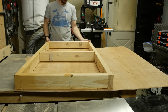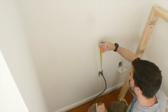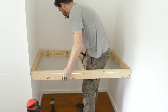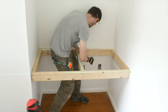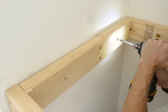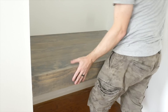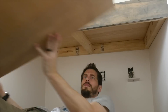I laid the frame over a piece of 1/8-inch plywood, cut it to size for the bottom, then measured up to the height where I wanted the frame to stop and used a laser level to mark that point on all three walls. I went around making several marks, then drove screws into each one of the 2x4s into studs and into the corners, filling in the rest with anchoring screws. I tested it and it's plenty strong. Then I sat the top on, did some adjusting and knocking, and once it fit I drove screws through the 2x4s into the frame of the front.